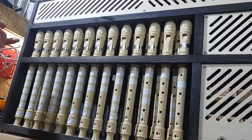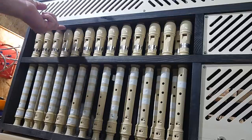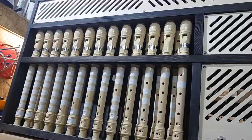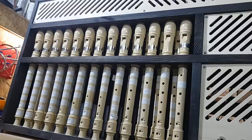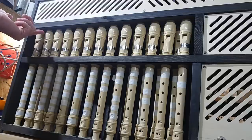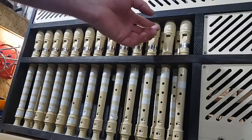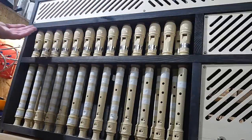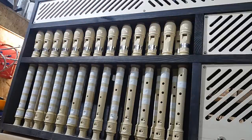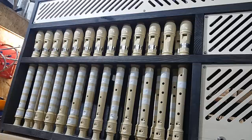I'm not lying when I say that this job was the most nerve-wracking of the entire process, because every one of these slots needs to be perfectly airtight. If not, the recorders won't play. And that's okay if you're screwing up on the first or second one and have to start all over again. But if you've done all this and you came to the 23rd, or maybe the second to last, and then you screw up, you've got to do them all over again. I lucked out - I think I only had to redo this top plate two, maybe three times. Not sure. Maybe I just suppressed that memory.